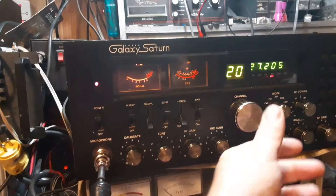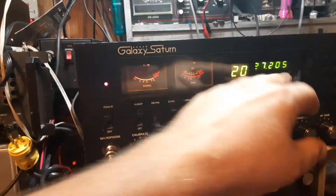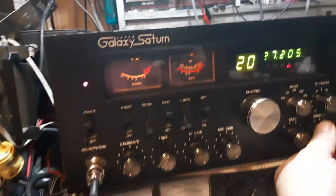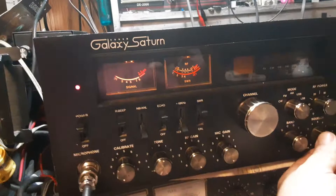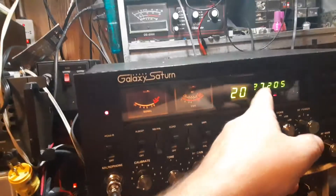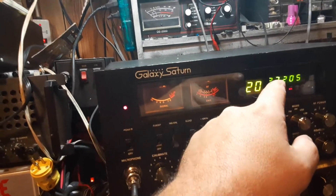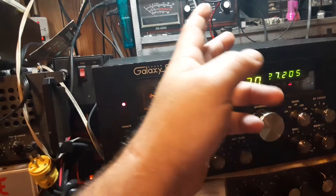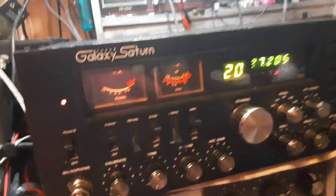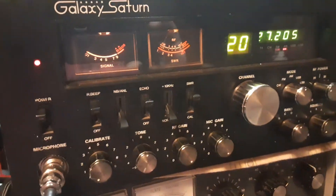Typical fading on the knobs and such here. The switches and controls were all dirty. When it first powered on, it was stuck — even though it turned off a PA, it was stuck. That frequency counter would constantly switch from the correct frequency to like 13-point-something, and it would fade in and out any time you keyed up. Power levels were way off, alignment way off.